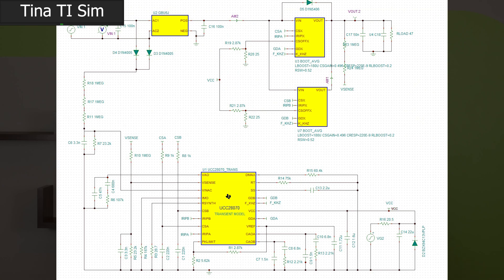When we left off our PFC design, we were using a homebrew approximated PFC in LTSpice. However, I bent to my desire of using the manufacturer release simulation model, fought my way into Tina TI, and downloaded the example simulation file. After pulling my component values into the base simulation, things looked pretty good — well, at first.